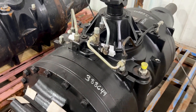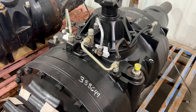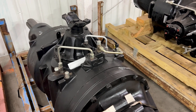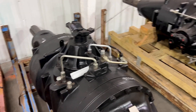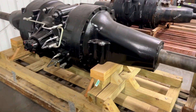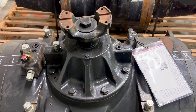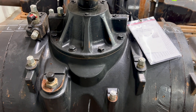When it comes to the differential, they'll pull the brake pack out, disassemble it, and put it back together with all new wear parts. They'll pull the differential out and check it, because these are prone to thrust washer issues — replacing anything that needs to be replaced, setting it all back up with new bearings. They'll check the other side retainer, press the bearings off the pinion shaft, set up the preload and backlash, and the final check once everything is assembled is a pressure check: if it has diff lock they'll do an engage/disengage, and on the brake they'll do 290 PSI for 10 minutes.